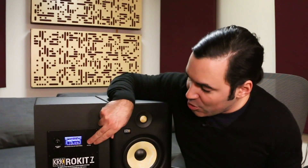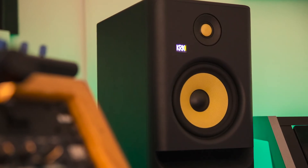All you have to do is get a cable out to your two speakers — they take a quarter-inch or XLR input. You can use this with any speakers: play some pink noise through them and see how far off you are from neutral and flat. If you get a set of KRK speakers, this app will even tell you exactly how you should adjust the EQ on it. You just take the preset EQ it recommends, go into the low frequency EQ, and select whatever preset it recommends based on the feedback from the app. This is super useful, especially for low shelving if you're close to a wall. Whether you have an inexpensive or a high-end set of speakers, evaluating whether you should be doing low shelving is the first thing to consider. That's why almost all active monitors these days have a low shelf built on — in a significant majority of cases, speakers are close enough to a wall where they'll need some shelving down.